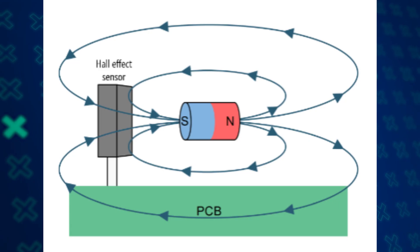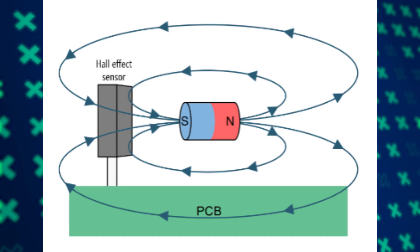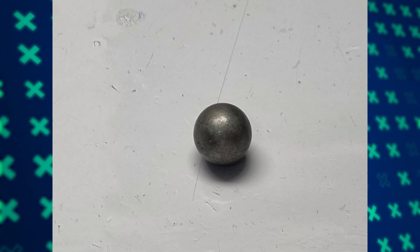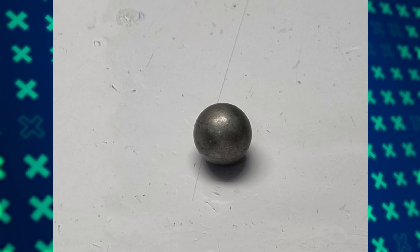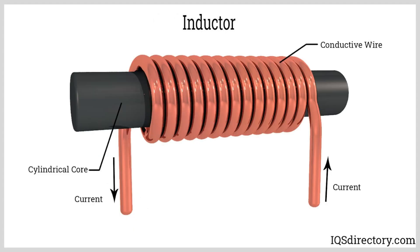In my original plan, I planned to accelerate an iron ball, but it was weak because the coil I designed wasn't made for driving a metal — it was made for magnets, since it didn't have a ferromagnetic core and outer casing. That would let the magnet get stuck in the coil, unlike an iron or steel ball that would have benefited from the magnetic permeability.